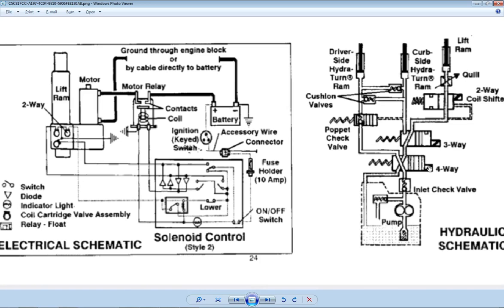A four-way valve, much like a four-way electrical switch, is also similar. When the valve is de-energized, these two ports on the bottom are connected to the top two ports, but they're crisscrossed — so the left coming in comes out the right up here, and the right coming in comes out the left. When it's energized, these connect straight through instead, so the left connects to the left and the right connects to the right.